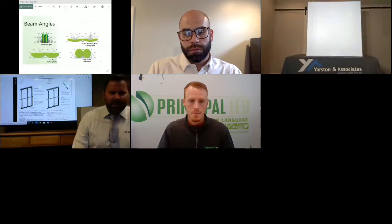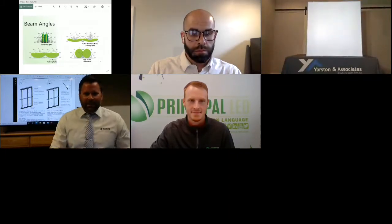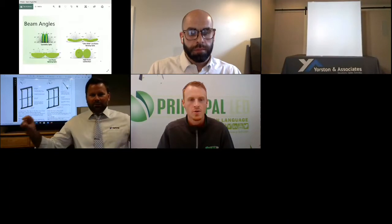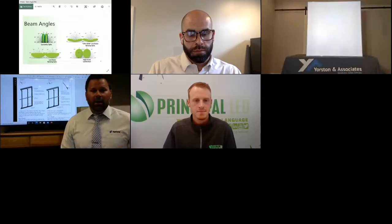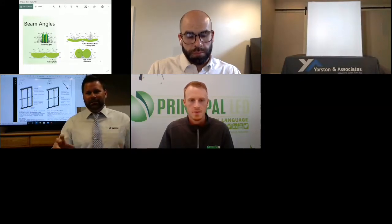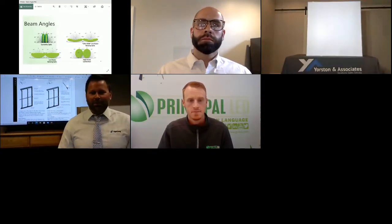Gotcha. I'm not going to name names, but I was at a customer's facility not too long ago, and he actually did something pretty neat. He had your sticks, and he marked where the frame supports were, and he attached them directly to the supports. Horizontally, because he only put vertical supports in, he had it attached directly to the backside of our frame braces. So no matter what, if he hinged that open, he just had a longer whip or a tail on it to service the power supply. By putting those directly onto the frame support, you were already bypassing that and no problems at all.